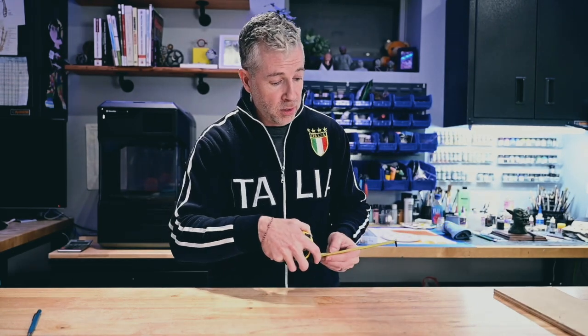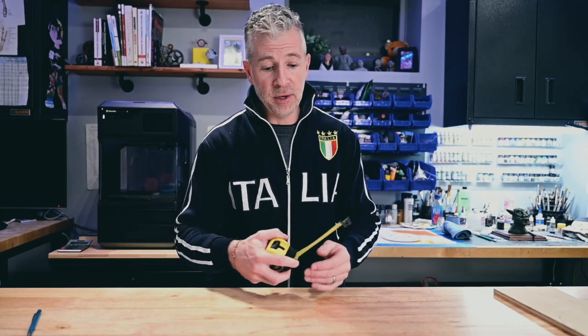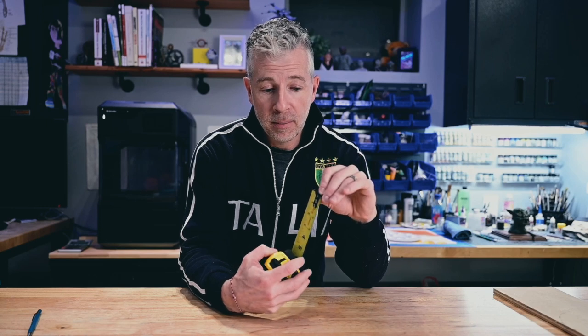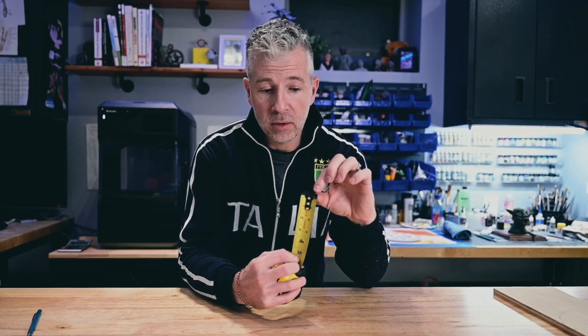Now, every time I snap it, which is unavoidable, I mean, you could fish it back really slow and work it, but most likely you will not do that on a job site because you're trying to get the job done. What happens every time you snap it is you are slamming this latch, and the latches can take a beating. Tape measures take a beating, but over time, the more you do that, your latch is going to start to shift about a 16th of an inch.